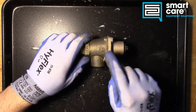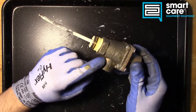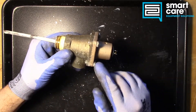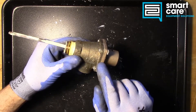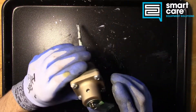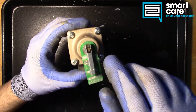We'll dump water. The dead giveaway for that is if this valve is opening up first thing in the morning when the booster is cold and you turn it on — if that booster heating up first thing in the morning opens this relief valve, the problem is not the relief valve. This is acting as intended. The problem is actually the pressure reducer, the regulator. There are booster-rated pressure reducers, but I don't have one here to show you at the moment.